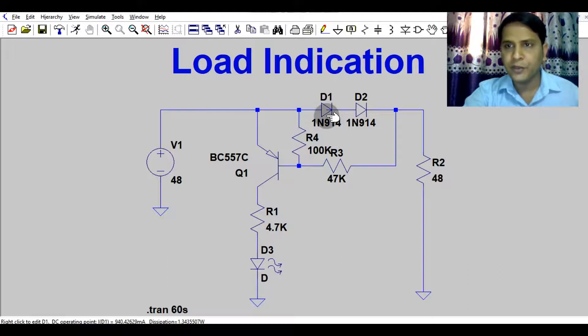We have two diodes D1 and D2 in a back-to-back configuration, though you can also use one diode. The potential difference between your emitter and your load output will be at least greater than the forward voltage drop of VD1 and VD2. The emitter will always see 48V, and the base will see 48V minus VD1 minus VD2.